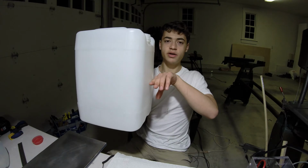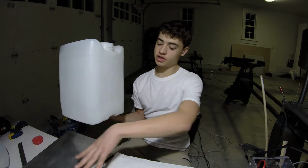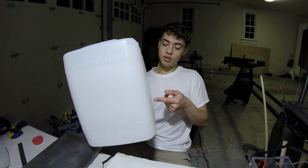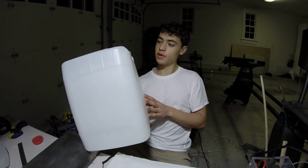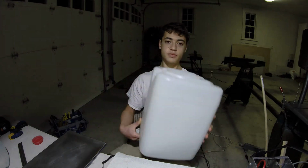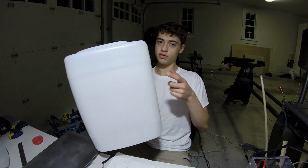I might want it more like right here, since the gaskets and stuff aren't perfectly aligned. If I don't have enough pressure pressing against it, small leaks might occur. I'd drill into it, but it's pretty thin, so I'm not sure how well I could tap it. I might be able to get a nylon hex nut, put my hand through this, and just clamp it, really tighten it, get some Teflon tape, stuff like that, to seal it. I could always put a bead of silicone or whatever.